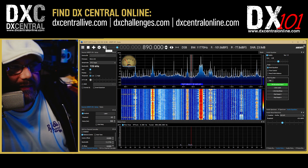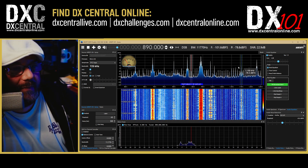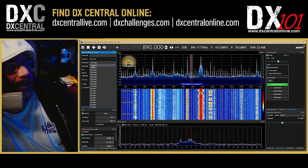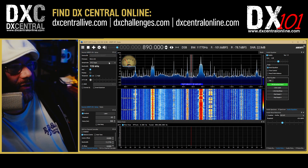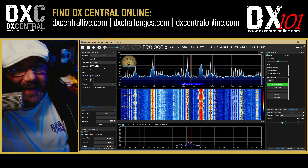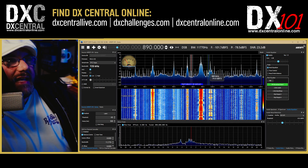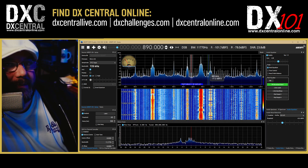The other thing you want to understand is your bandwidth and how that relates to your center frequency, and how you can set your frequency range for recording in the waterfall. When you load up, it usually defaults to a sample rate of 912 kilo samples per second. That's going to get you a bandwidth of 725 kilohertz wide at one time. Some folks will knock the AirSpy for not recording the entire band, but 725 kilohertz can actually be pretty good. So if I have this full 725 kilohertz range, how do I set it to record only part of the band I want — like the lower half or the upper half?